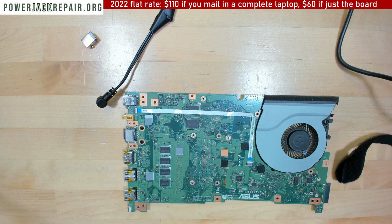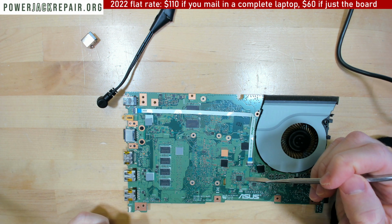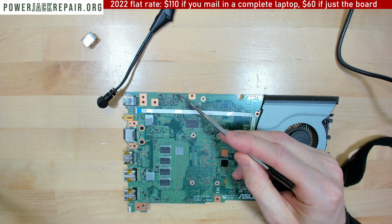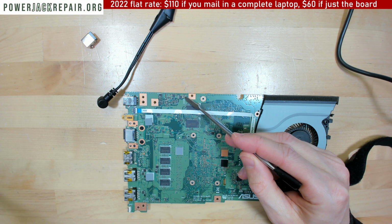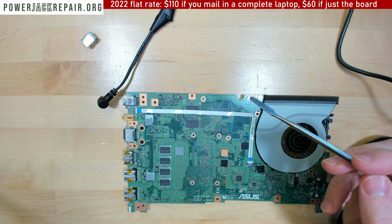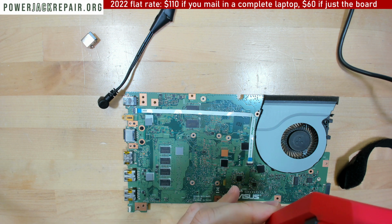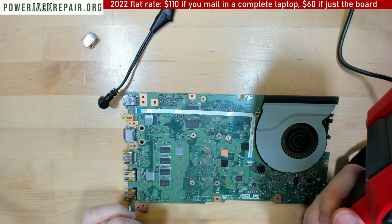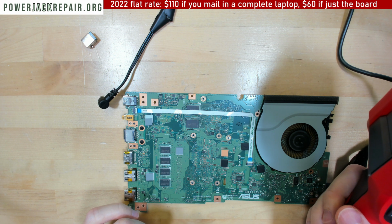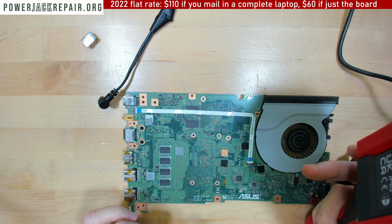So what I'm gonna do is solder a wire to right here, and we're gonna inject the voltage. Because we bypassed the two MOSFETs, we're gonna inject the voltage right here, and look on the thermal camera how things are and where they're at. So let's hope that my camera is working and connected. Let's see. The infrared doesn't want to power up for some reason.